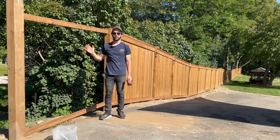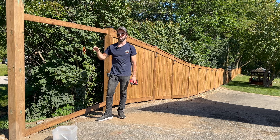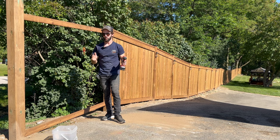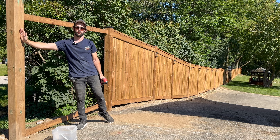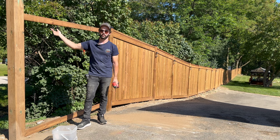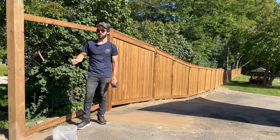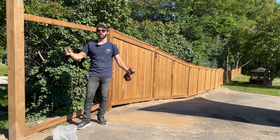When I said you can space posts eight feet, that's the maximum on center — because lumber comes in eight-foot sections and the next size is ten feet. If you space posts actually eight feet in between, you typically can't line them up perfectly, so the most you'd go is eight feet center to center so your eight-foot material just needs a small cut. And you're not just going to measure eight-foot centers — you'll measure the full distance and divide it up for equal size panels. If you start on one side you can end up with a small or half panel, so it's best to get a measurement and divide the space.